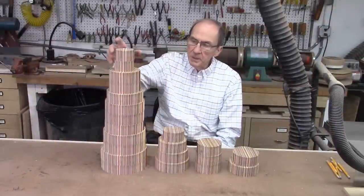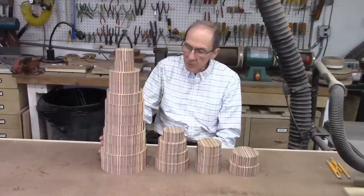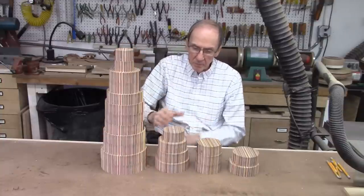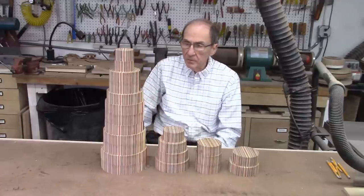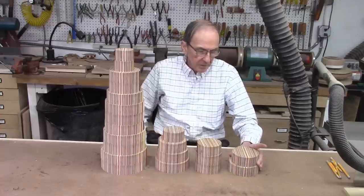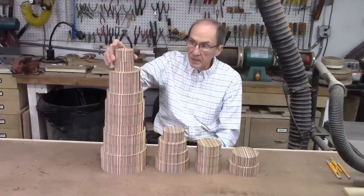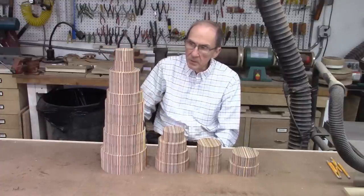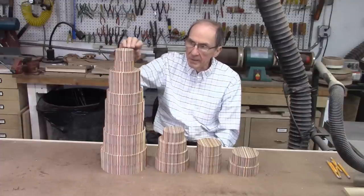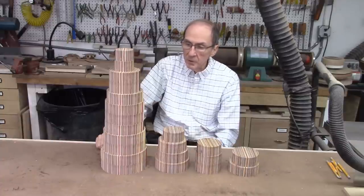This is the result of all those pieces of wood left over from that double dizzy bowl vase. I glued these all up and got a total of 21 discs out of all of those scraps. These are all in one particular pattern; these others are a slightly different pattern where the alignment of the layers is slightly different, so these will make separate projects. This group will probably make some bangle bracelets and maybe some bracelets, some small bowls, and maybe one or two bowls or eggs. The next step is to glue these up to some pieces of MDF and then slice off my layers a hundred thousandths of an inch thick, and then I can start arranging these into patterns for various projects.